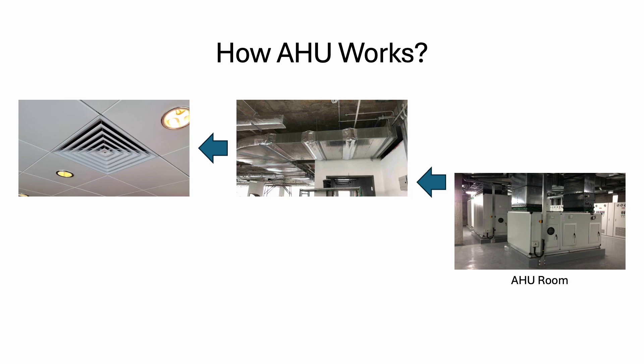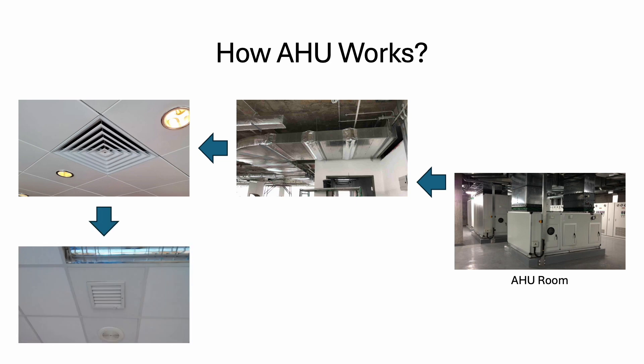So if you go inside any room, you don't see any air conditioner, but there's cold air — probably using AHU. Especially those big buildings like hospitals or shopping malls. After the air cools the room, it will go back to the AHU because it's a recirculation — it will be sucked back to the ceiling. Here you can see the grill looks something like this.